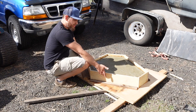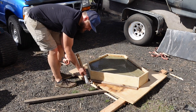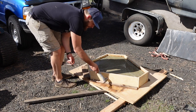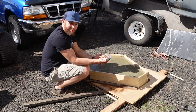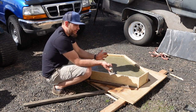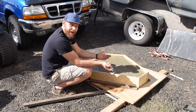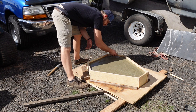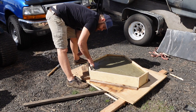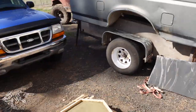The other thing you want to do is gently tap your forms around the perimeter — that gets all the air bubbles off the edge so it looks nice. Don't go too crazy because the forms might blow apart. When edging it right now, I'm really just knocking the rocks down because the cream is going to fill in the edges again. This is not the final finish — this is just trying to get the rocks knocked down so when we finish it later in about an hour, we don't have to fight the rocks. We'll let that set for about an hour and then hit it again with the trowel.